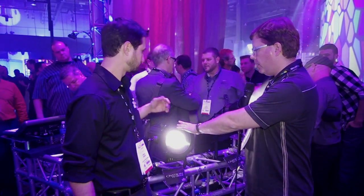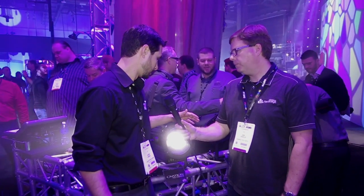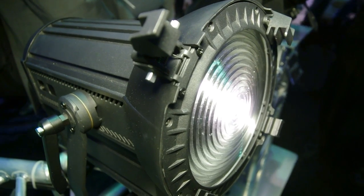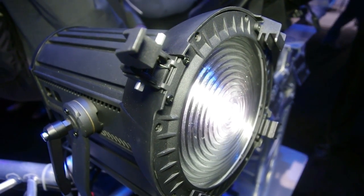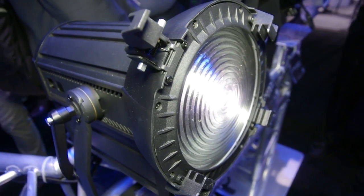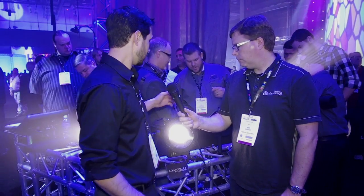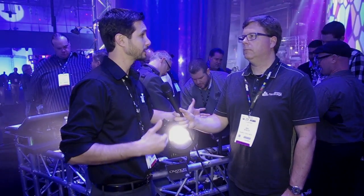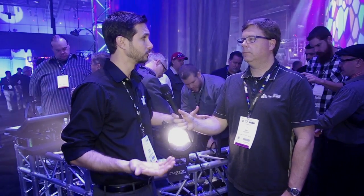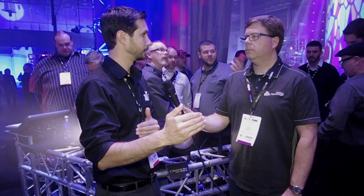The fresnel version — tell us a little bit about that. This one has 15 x 10-watt LEDs and it's extremely bright. It has a five-degree all the way to 54-degree zoom range on it. What's actually really interesting about this fixture is that because it has the DMX-able zoom on it, you can still use the zoom range on it when you're not using DMX — you just have to wait until it's fully up on the dimmer.